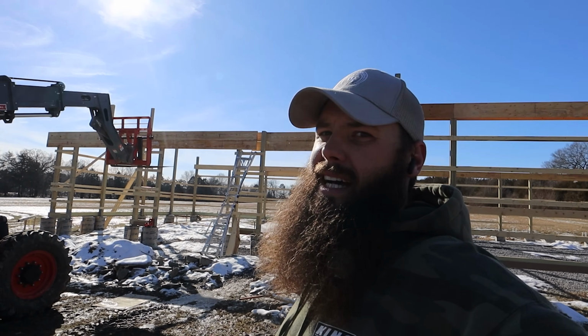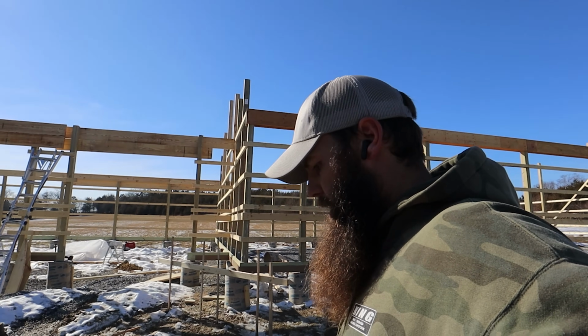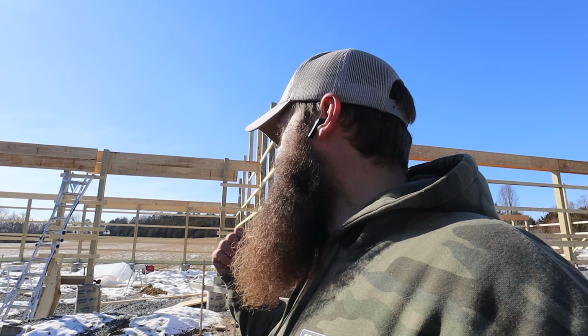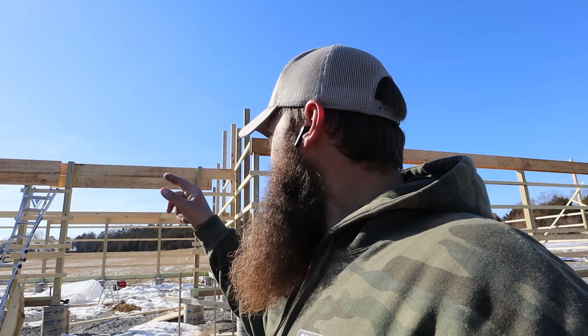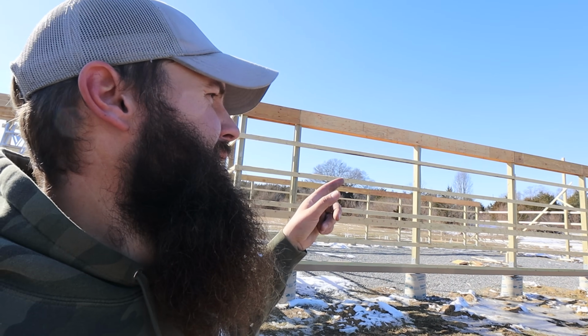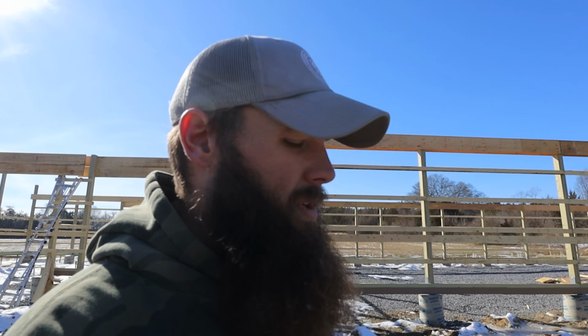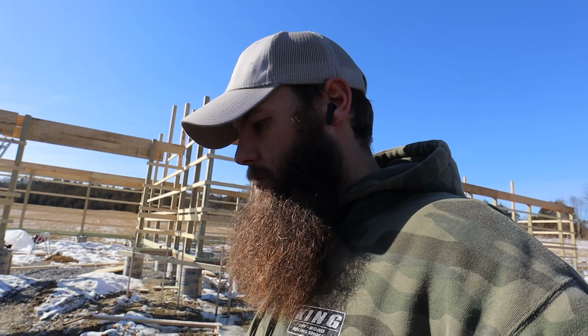And then we just gotta do the headers on the inside for the garage doors. So those call for 10 foot just to span across the door, but I think I'll run 16s just to give it more support. So I got a couple grade boards to install, and then we got 1, 2, 3, 4 2x4 girts on the top to hold the trusses up, and then I'm pretty sure we're ready for trusses. So tomorrow will be trusses. Tomorrow for us, it won't be tomorrow for you guys, but yeah, we are almost ready for trusses, and then it'll start looking like a house. So that's probably where I'll end this video, and then we'll pick back up with trusses in the next video.